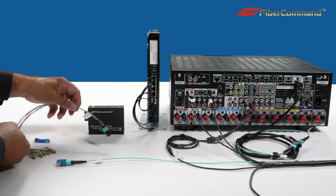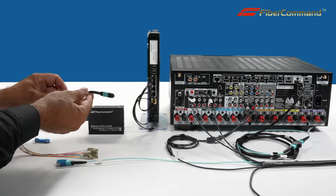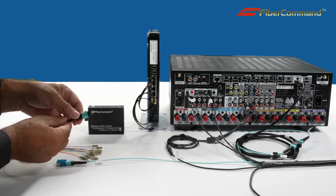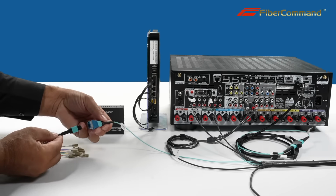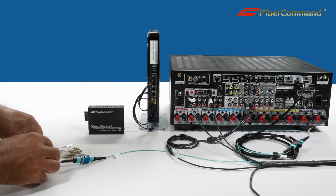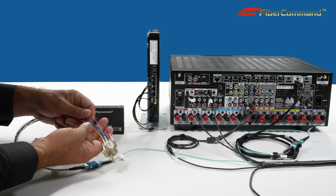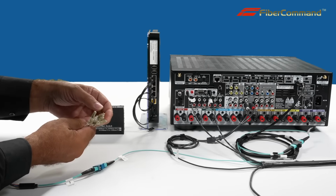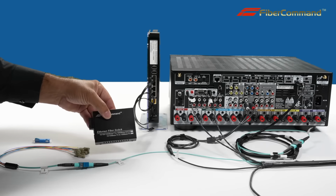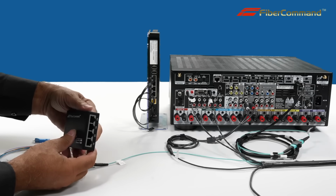Now use the pigtail to access the single fibers of the cable via standard LC plugs. Remove the protective cap on the fiber pigtail, then connect to the main cable plug marked as number 3, pushing in until it is locked and secured. There are 12 standard LC plugs per each fiber pigtail, and each LC plug can connect to an independent device up to 100 gigabits of speed. In this example, we will use one LC fiber to plug into the Ethernet adapter to connect the internet modem to the room with full fiber optic speed.